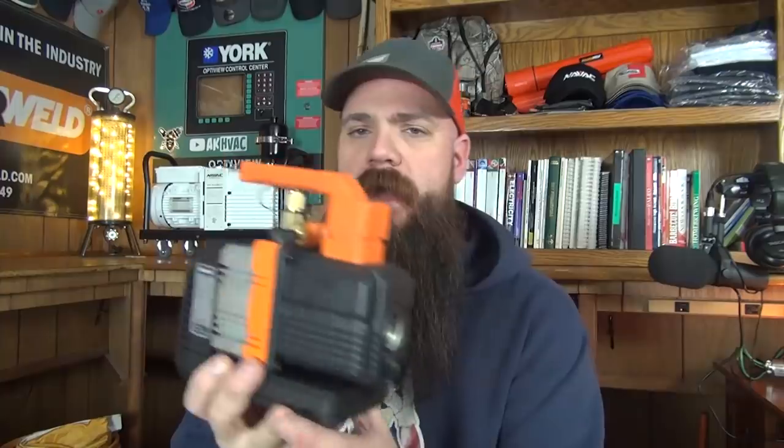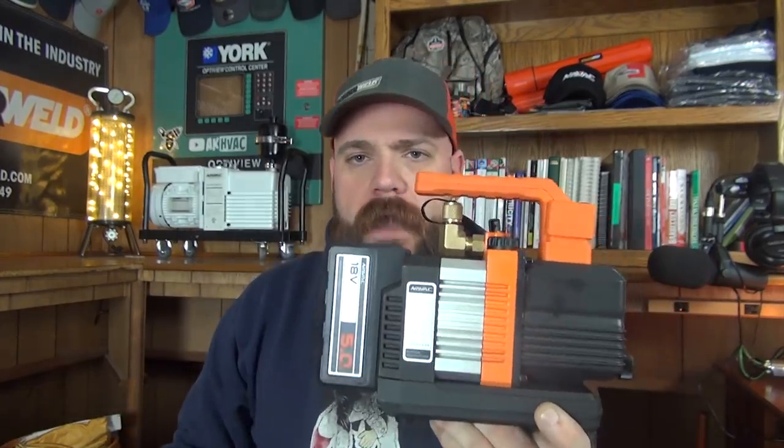I know I've always thought of a day that maybe we'd have these things run on a battery, but I didn't think it'd be in my career or something that was reasonable or cost effective. But as of 2019, the opportunity is there to pick up the new NAVAC NP2DLM. It is a 2 CFM battery-operated vacuum pump. It runs on 18-volt batteries branded as NAVAC batteries. I don't know who actually makes them, but if I had to take a stab at it based off the sound you get when you plug into the charger, I would go with Makita.